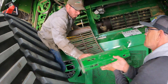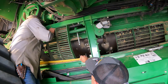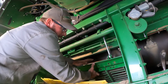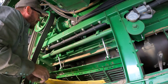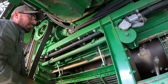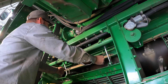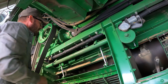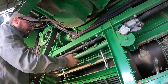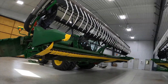Now the bean concaves. You pin that in first and then it folds up there and then that bolts to each of these concaves. Then we've got to adjust it — this is how you adjust your concave clearance, either tightening or loosening it. And that's from the inside. From inside the cab, this is the motor that controls it. It lifts on these rods to lift these concaves closer to the rotor. We've got to go through our procedure of leveling this and setting our clearance. Bo and Ivan got the air bars put on last week, so they're all ready to go — both headers.